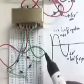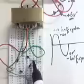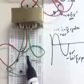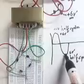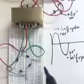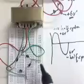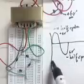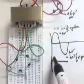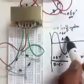When the right hand tap is in the positive half cycle, this portion of the bridge will be conducting, because this diode conducts only in one direction. The moment it reverses into the negative half cycle, this diode will not be conducting — the negative half cycle will be blocked. So the total DC output we get is 6 volts. This will be direct current, and the input is alternating current.